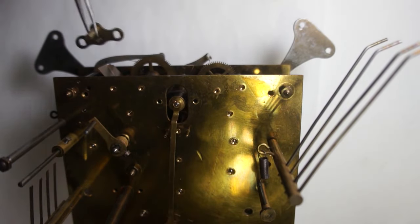So I had this piece of brass mounted on this mandrel, and I mounted it with some super glue, and I've just gone ahead and heated it up a little bit, and it released it now. So next thing I need to do is, since these threads on the screw already fit that door, I'm going to go ahead and turn the head down on the screw so that it friction fits into this knob.